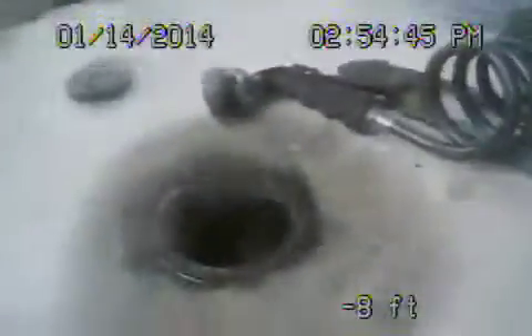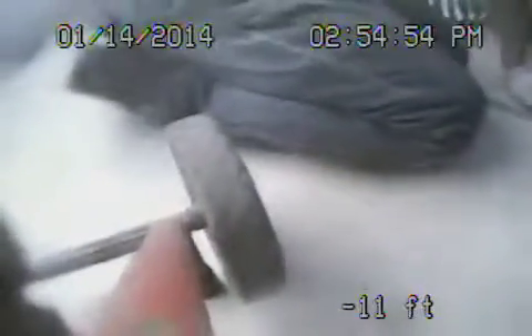Here we are on the side of the house running from the clean-out. So the 6-inch in the street looks good. The 4-inch pipe does have heavy to moderate roots, which we recommend to reline that section with the 4-inch clay pipe that heads underneath the walkway — that would be a permanent fix. You can maintain the sewer line with a hydrojet, either on an annual basis or every two years.